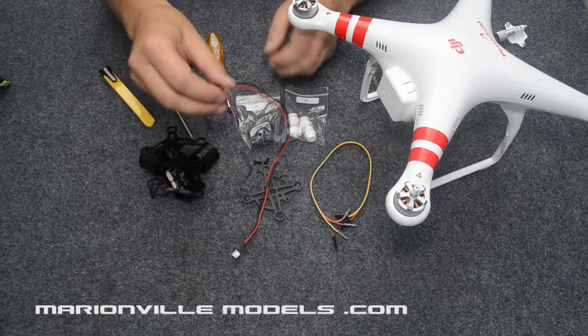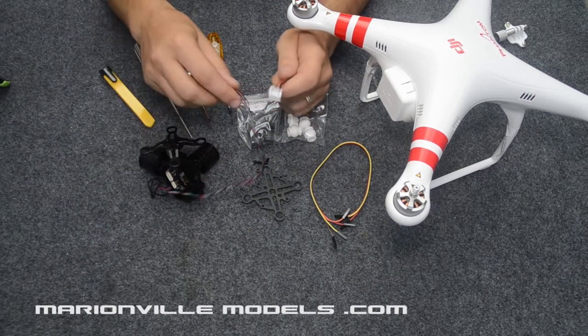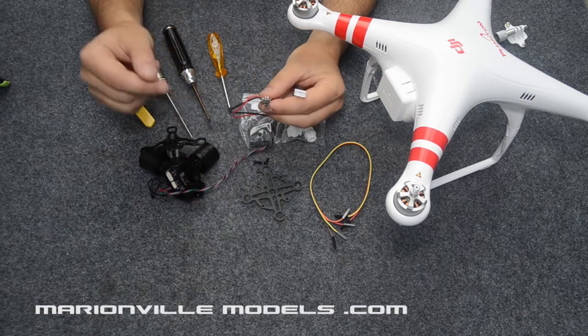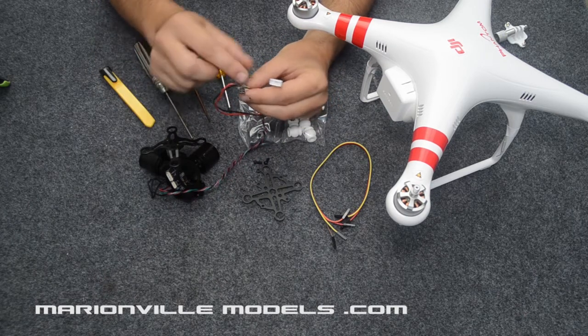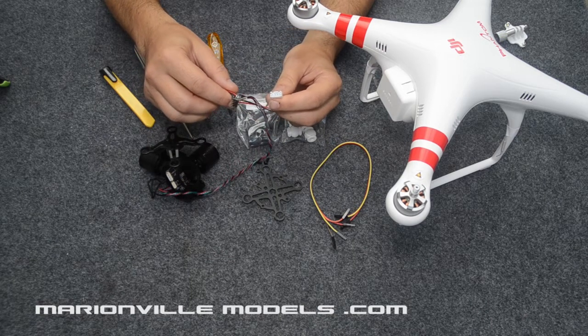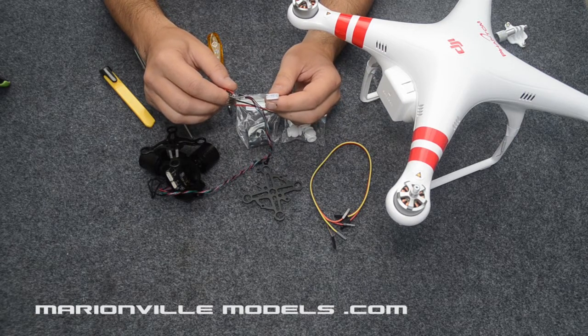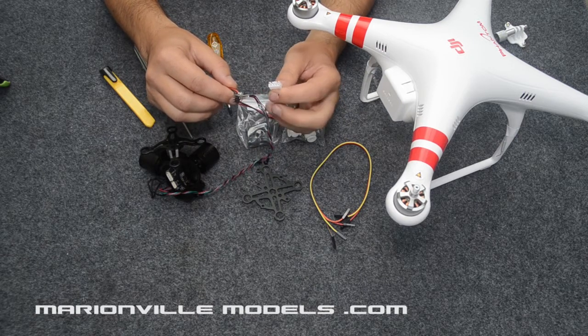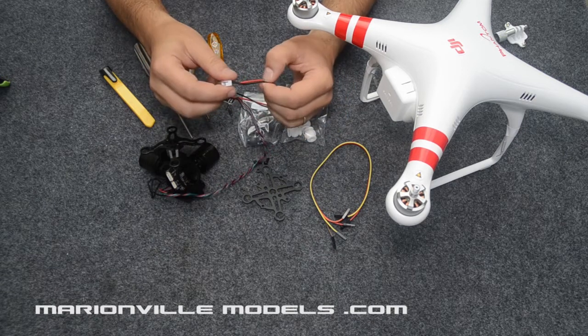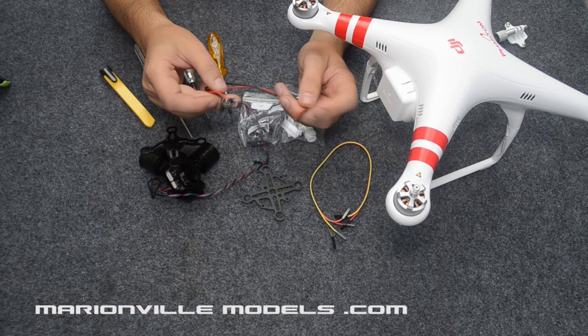And then the other part you have is the wiring harness for the gimbal itself. To make it plug and play, they put these sort of remote cables on. So you've got one that's designed just to go into a three cell LiPo battery. So if you were building like a 450, which has all got external stuff, this would make it quite easy to fit. So that is where your battery goes in that powers the gimbal. However, that could be cut off and actually hardwired into the model.